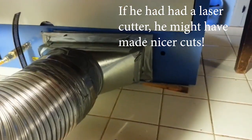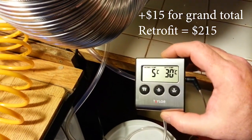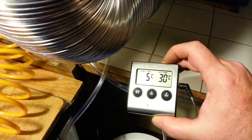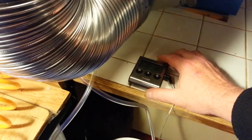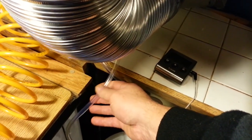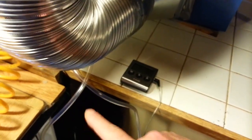I'm able to access my laser tube. I changed out the water supply hoses to a more heavy duty hose — a little firmer and less likely to kink. I'm worried about keeping the flow to the tube. I also purchased one additional item that wasn't in my original video: a little temperature gauge. It has a warning alarm and I set it to 30 degrees Celsius — if the water temperature hits 30 degrees, I need to shut down and cool the water off. We'll see how long it takes to bring two and a half gallons of water up to 30 degrees; I think I'll get a pretty good run. But don't count entirely on these gauges — always come and check the hose from time to time to make sure it's not hot. These temperature gauges are fairly decent but they have a reputation for going out when you don't expect it, so you're kind of counting on that to keep your tube alive.